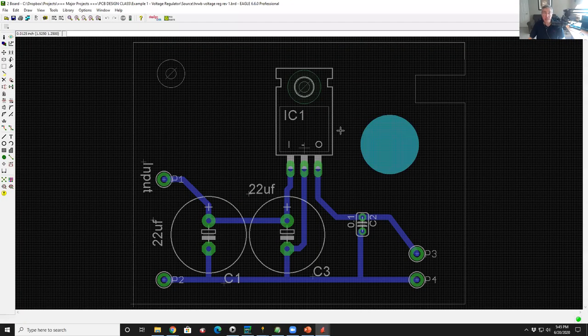And the good news is you don't have to be too concerned about this, because the odds are you're never going to design a board that gets close to the fabrication limits. You can just run a design rule check with the standard rules, and they will probably be perfectly fine. The only reason you would ever modify the rules is if you were really pushing the limits, or you had a corporate standard and you had to enforce it and prove it. So I've never modified the design rule definition file.